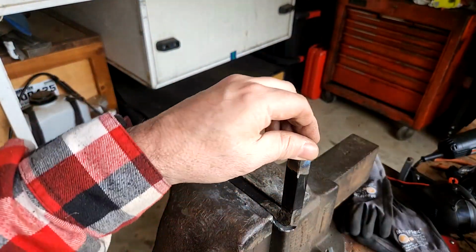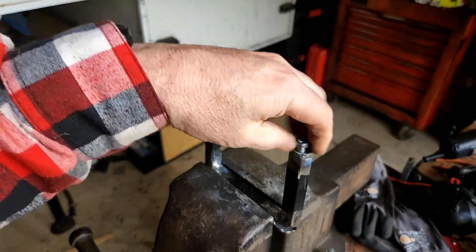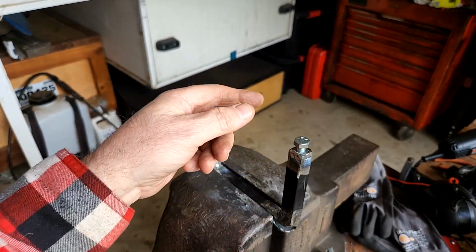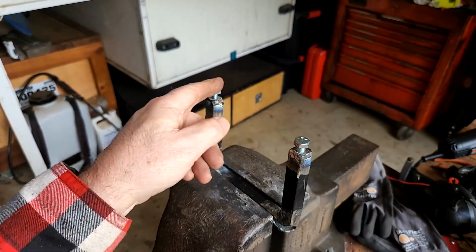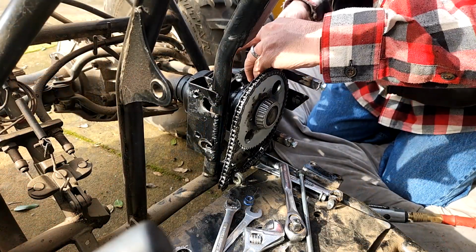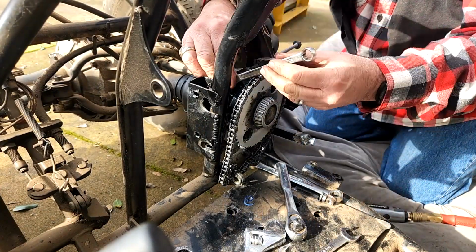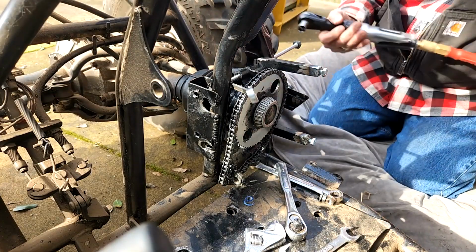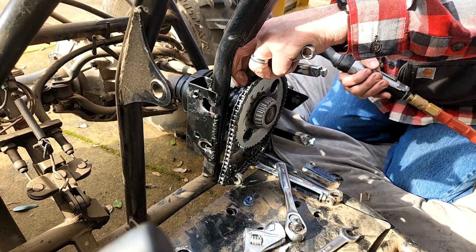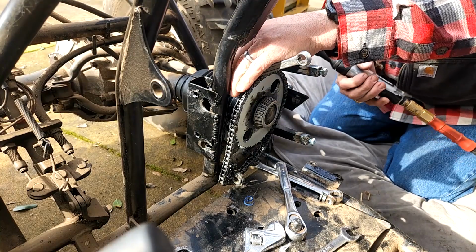So with these bolts in place, I can put a plate over the top of this and tighten it down, and that way I have a way to put it together in pieces rather than having to make one big cage. When I put things together like this 2 years ago, I didn't have an idea of how much the motor torque would pull on this sprocket. So even though I was drifting away from the one cage idea I started with, I still needed to keep in mind that ultimately the assembled parts had to be held rigidly together in the end.